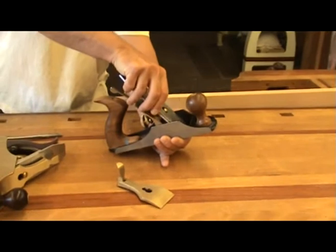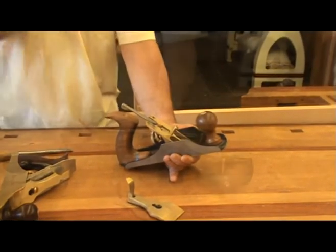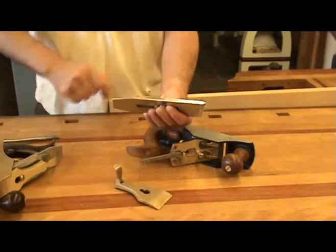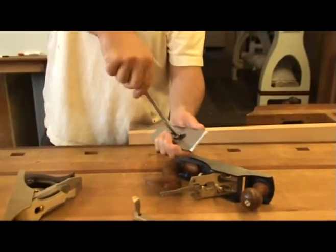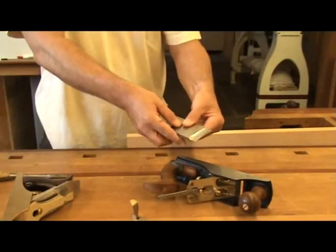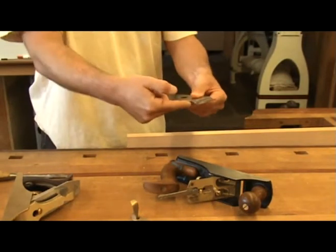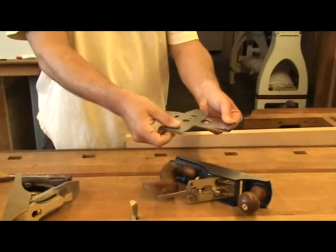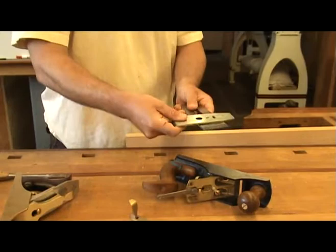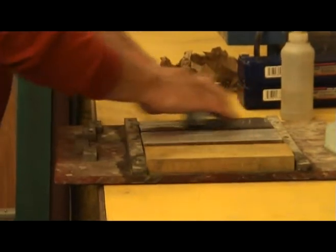You want to be careful when removing these parts so you don't damage the business end of the iron. With the chip breaker on top and the iron below, the bevel is indeed on the bottom. This assembly must be separated in order to sharpen the iron. Loosen the screw and carefully slide the chip breaker back away from the front edge of the iron, making sure no metal hits the front edge. Turn the plane iron sideways and slide it forward so that the screw on the chip breaker slides out through the keyhole in the iron.